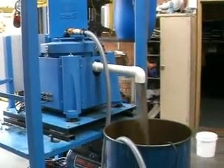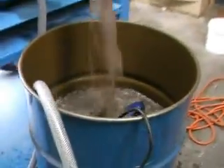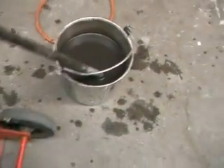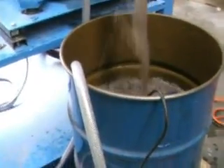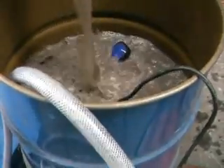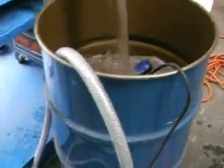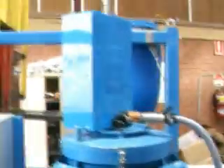Centrifuge vertical clean — it's been running for approximately 15 minutes. What we did was 10 litres of concentrated mud, as you can see here. It's got about 1 litre left in it where we've mixed it up and diluted it down with water. We've filled that up to about that level with water, then mixed up about 7 litres of mud thereabouts in there. So it's been running for about 15 minutes.